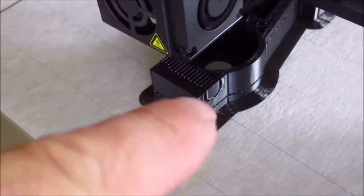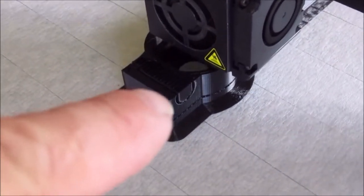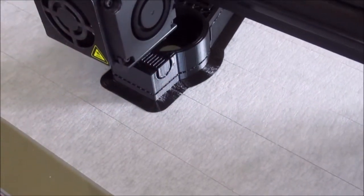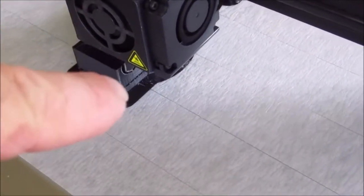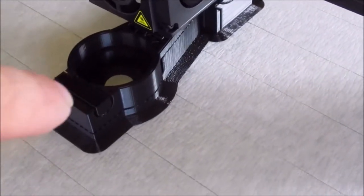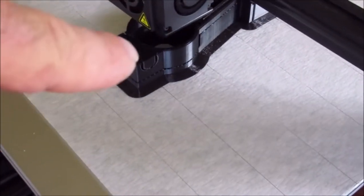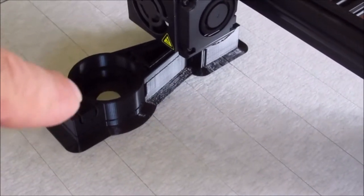What you see on the end is where the drive screw, or the drive bolt, drive gear, is going to be. The worm gear goes in that circle, and the driver goes right here, and it's the pitch of the driver that's going to determine how much movement of degree is going to take place for every revolution of that drive screw.